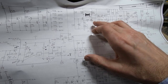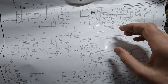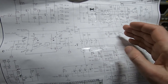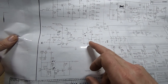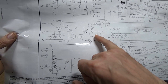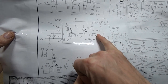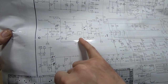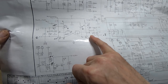It's fairly critical in terms of its maximum speed, which makes sense. In my book on the transistor microprocessor I discussed the difficulties in designing discrete machines like this because of the timing requirements throughout the individual circuits — and that's what this started looking like. Looking at the flip-flops in the ALU and connected latches, sure enough one of them wasn't latching quickly enough. When single-stepping it worked, but the output was taking about six microseconds to change — way too slow — and was now and again seeing the wrong value on its output.